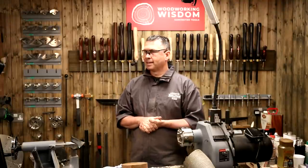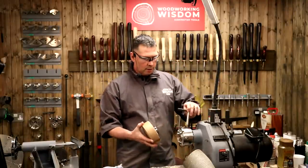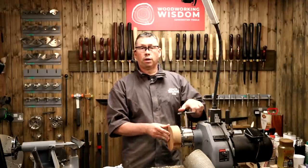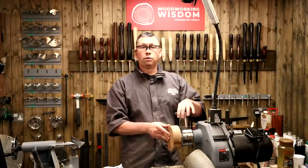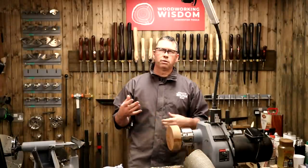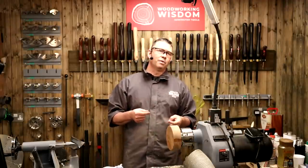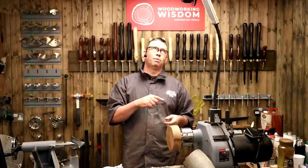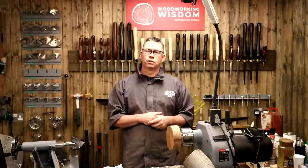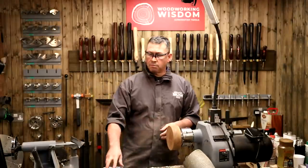Okay. A question from Chris. Will building up the layers of finishing oil work on ash, cherry, and sycamore? Yes, absolutely will. Building up layers works on pretty much any timber I know, to be honest. And don't forget, you can also wax over the top of oil. Oiling over wax doesn't work as well, but waxing over oil works nicely. But no, just keep building up, experiment. I haven't found a timber that doesn't work that way.